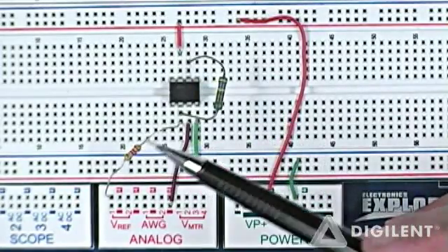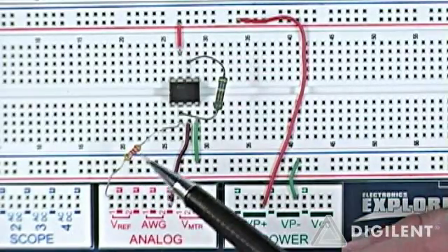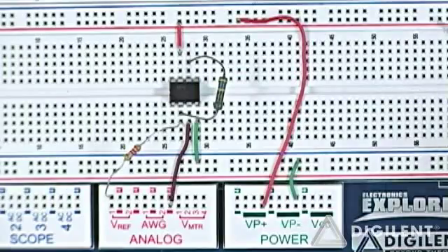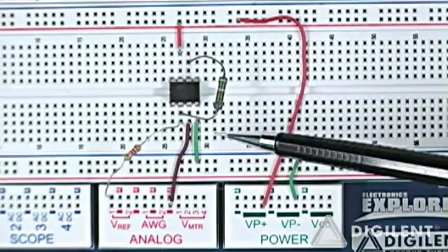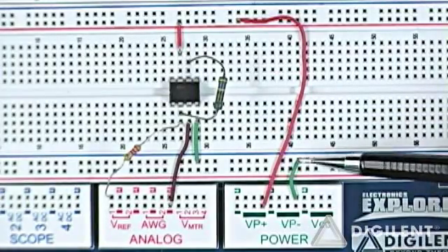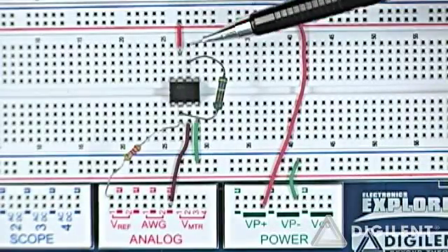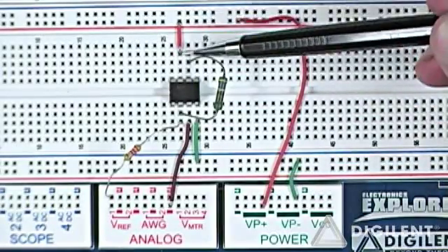I've picked these resistors such that they give me a gain of about 2. Furthermore, I have a 2.4 kiloohm resistor here, which should give me my desired input resistance of about 2 kiloohms. I need to provide power to this operational amplifier for it to do its job. Vref provides the input, but I need 2 additional power supplies: the negative voltage supply at pin 4, so Vp minus is going to this strip which then goes to pin 4, and Vp plus is providing the positive power supply voltage at pin 7, going up to this strip which is then connected to pin 7.